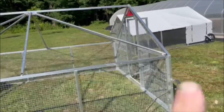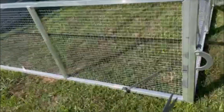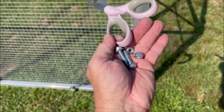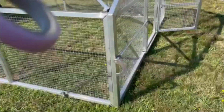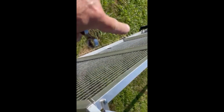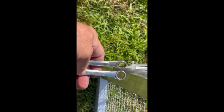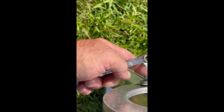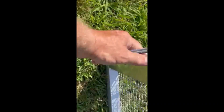The next step is to cut the cable ties on the lifting mechanism, pulley system, and wheels, then bolt it with one and a quarter inch screws with lock nuts. After you cut that, you can pull this up — this is how this goes together. It'll take two tools to tighten that, but you don't want it too tight. Just get the lock nut down where the bolt is coming through the end — good enough so it won't back out — and you want it nice and loose so when you pull it, it'll move. You can adjust it too: if you move it this way it lifts the wheel higher.